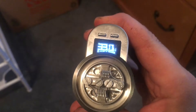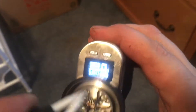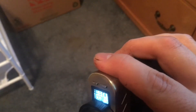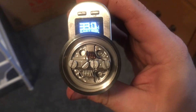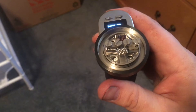This measures out at 0.19 ohm — actually 0.17 ohm. Obviously I need to tighten down some of these leads. Much, much tighter. Now, one thing I've found is if you have one coil glowing faster than the other, it usually means you have some loose screws. I'm going to have to do this off camera — I'm still not used to it. I'm going to come back once it's glowing, show it off, and wick it up.